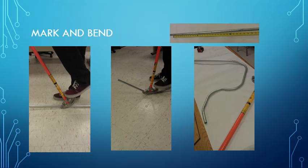And so here we have where we laid out our conduit, and because conduit is one straight line, we marked it and put it on the floor and practiced bending this shape. And you can see right here on the right when we had our finished shape, we had to have this excess in order to bend that. We don't actually start until right here. That's where we have to cut it off to get to the panel. And you can see this bend was mathematically only taking up 1.12 inches, and you can see that it needed considerably more than that in order to get out to space.